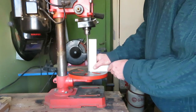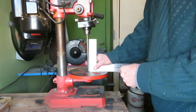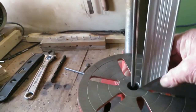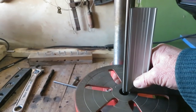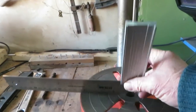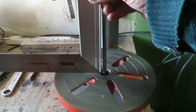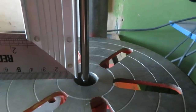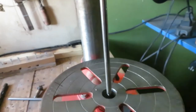In this case we can see that there's a significant deviation up here, and that means we have a crooked hole. Now if we look at it in this other position we'll see that there's no deviation with the square, but we also must measure it on the other side — and here we can see that there's an enormous deviation between the square and the bit.